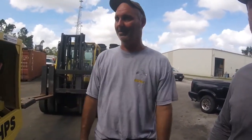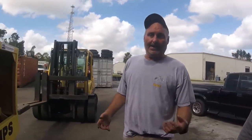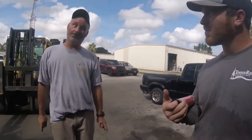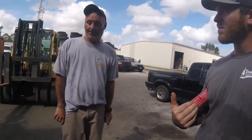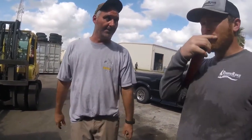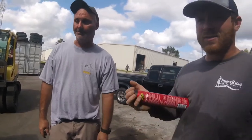That's right. Now, you take into consideration, if this thing is running at 250 hours and you only pump 30 yards, then I probably wouldn't do the hydraulic filter. When this thing's running, we're going to be pumping material for sure. Now, if you make 6 or 8 months, even though you only got 40 yards on it, you're going to have to change the filter, because it's a paper filter in a steel element, so the paper will get funky and start fluffing off.